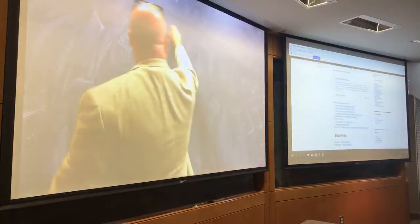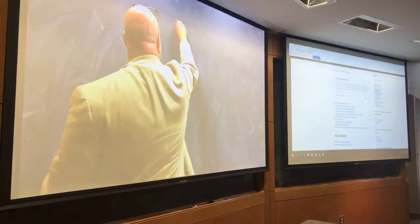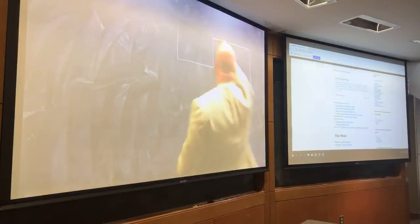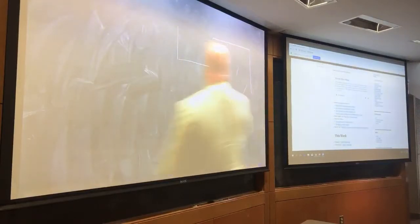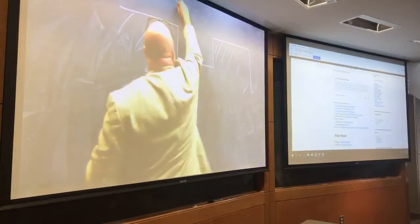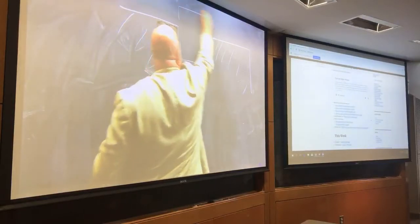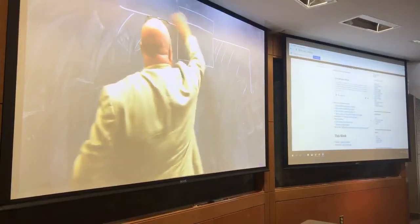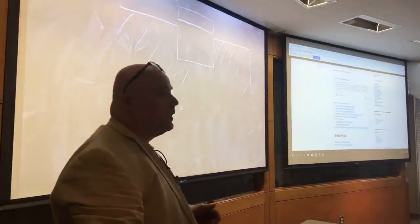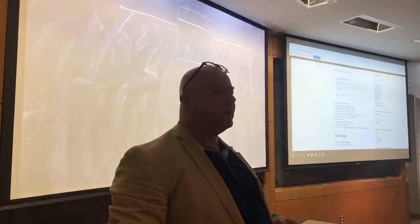So if we look at a cross section here, we've got our bearing hole. Say we're pressing the bearing down here in our cross section. If it's a press fit with a bearing, which is going to be bigger? So this is the bearing, this is the hole. If it's a press fit, which part's going to be bigger? The bearing. It's going to be a little bit bigger.